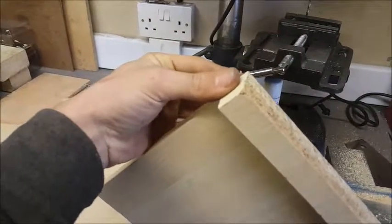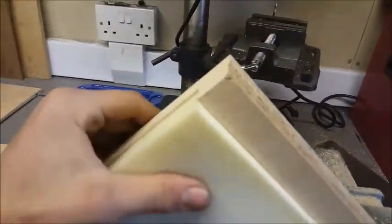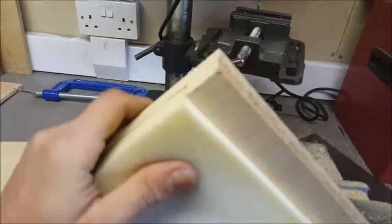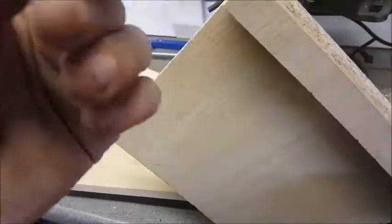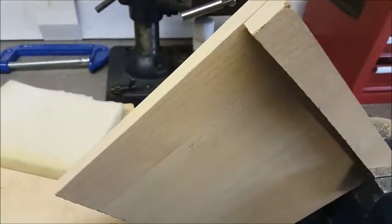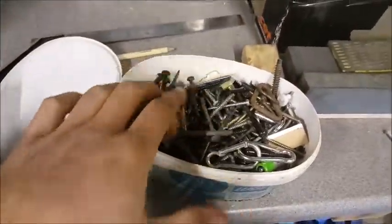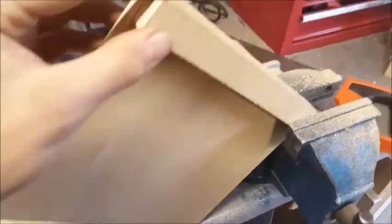I also need to mention that you need a little bit of a stop — this will act as almost a spacer between the two pieces. Because if I try to clamp them without this, there would be a big problem: I wouldn't have any kind of spacing, there'd be uneven forming, it wouldn't form as well near the back, and it'd start to crush the wood. So I'm just going to take some screws from my box of things, shut those in there to keep it, then we can apply our hinge and we're pretty much done.